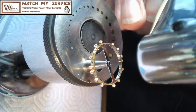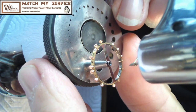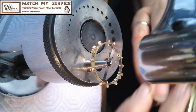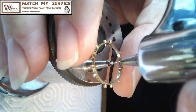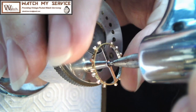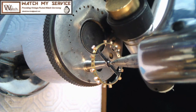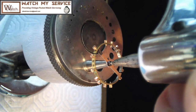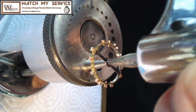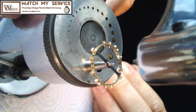I've got a stake that's slightly smaller in diameter on the end, which ensures that when I punch the staff down through this detachable hub I'm not pounding on that detachable hub at all - I'm only touching the staff itself. I'm fitting it in here nice and loosely and it shouldn't take much effort to get this in if it was fitted right. As you can see, this stake fits perfectly onto that little edge of the balance staff. I want to make sure that edge the stake is resting on is parallel with the top of the hub - it's kind of conic on the inside so the balance staff is also conic and the two of them fit together.